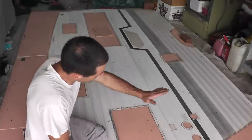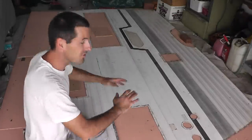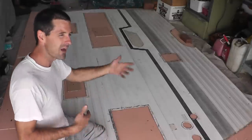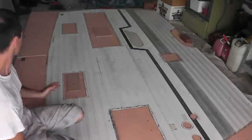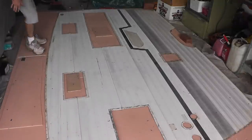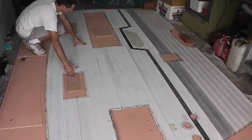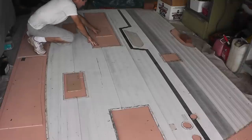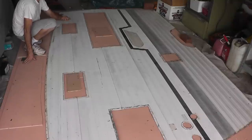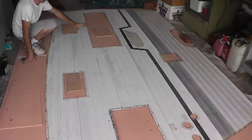The siding is screwed down to the paneling and I've traced the pattern of the wall. Now I need to remove the siding and start framing. One thing I did a little differently this time is that instead of using just tape to hold the individual pieces of plywood together, I went ahead and got some scrap pieces of paneling and screwed them to the plywood at the seams, so there will be minimal slippage and distortion when I remove the siding and try to build the wall.